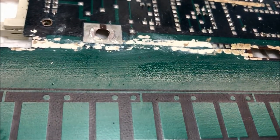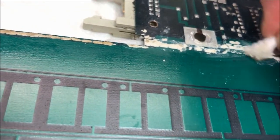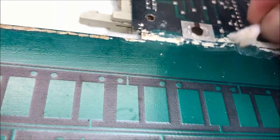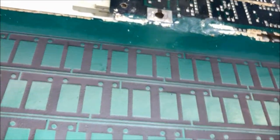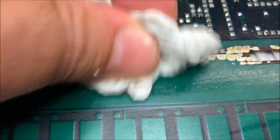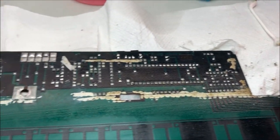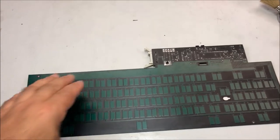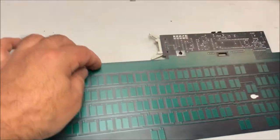On the board I have glue with white color. I'm going to use alcohol to dissolve the glue and the residue, then use paper together with alcohol to remove the residues and clean it up. The cleaning process is finished — it's not perfect, there are some oxidation signs, but it's not too bad. The back side is also better, and where the electronics populate the board it's nice and clean. The connector is clean as well.